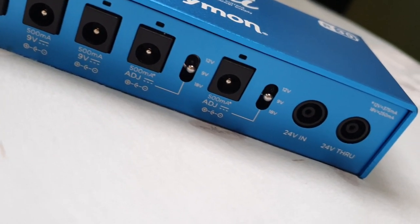Let's talk about the actual power supply unit. It has five outputs: outputs one, two, and three are 9 volts at 500 milliamps each. That's a lot of power — most guitar pedals, especially digital ones, use less than 100 milliamps on average, about 40 to 50 milliamps. That means you can also purchase a splitter separately — one input to two outputs — to connect two pedals using one port. But be warned: make sure those two pedals don't cross-talk, as for example a distortion pedal might leak into a delay pedal causing unwanted noise. Test around first to make sure it's safe.